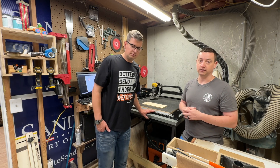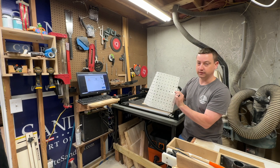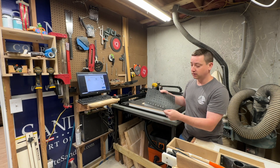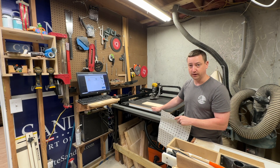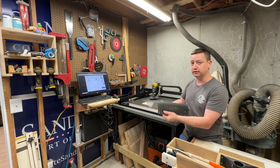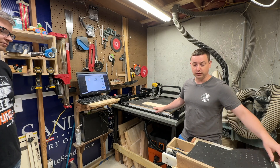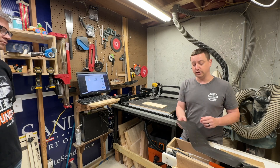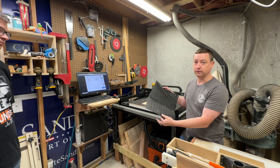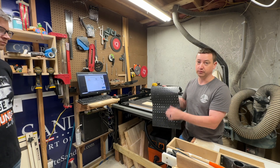Let me show you a little bit about the tile gasket. So this is a piece of the tile gasket — it's adhesive backed and comes from All-Star CNC. All you're going to do is stick this down to your MDF. It's a pretty thin product, a 16th of an inch. When setting your Z height for profile cuts, you want to cut into this tile gasket only about 0.02 to 0.03 inches. That's going to help extend the life of the tile gasket because this is the consumable product. Instead of cutting into MDF like a traditional spoil board, you're cutting into this gasket material. The good thing is these tiles are extremely easy to replace — just peel them up, toss it, and put down a new one. If you accidentally blow through a tile, not a big deal.